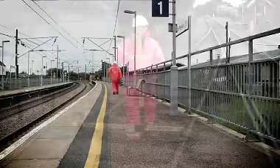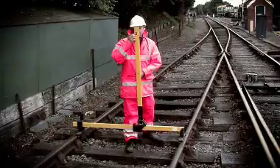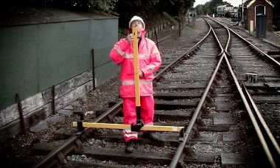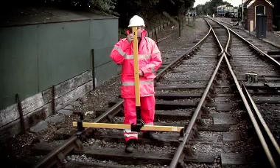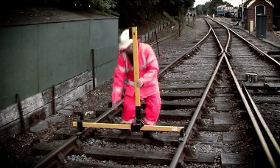On track, simply look through the 90 degree viewing prism on the laser unit whilst adjusting the stagger by twisting the wheel, located on the vertical beam, until the red laser beam is displayed on the overhead line equipment. The height reading is then displayed on the illuminated LCD screen of the laser unit.